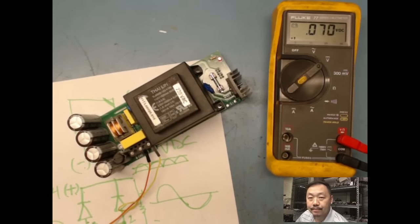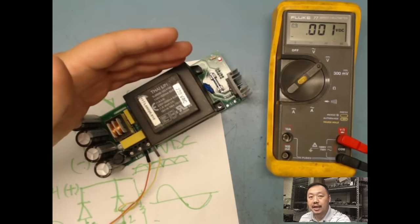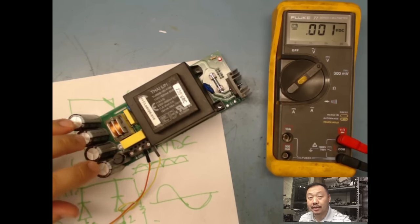If you have a resistor that's handy with a high wattage or something, don't use your screwdriver, just touch the resistor across there and you would use it as a load and it would discharge. So that's basically what I would do if I didn't find anything. In most cases we don't find anything, but if we do find something, it would be in the bridge rectifier side and fuse would be open. And sometimes transformers do open up, and if it does open up, we won't get any voltage to the secondary side. So if no AC voltage is on the secondary side, then it definitely won't get to the bridge rectifier, right? We didn't test the LED because I knew we were going to power up. LED is going to come on anyways, so I didn't check that. But caps seem to be holding up fine, because when I took the power off, these four caps are still holding their charge, so the caps seem fine.